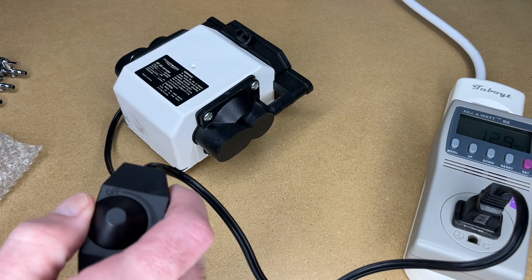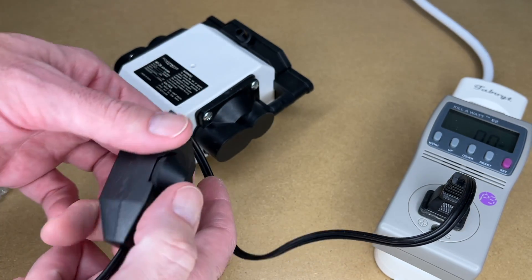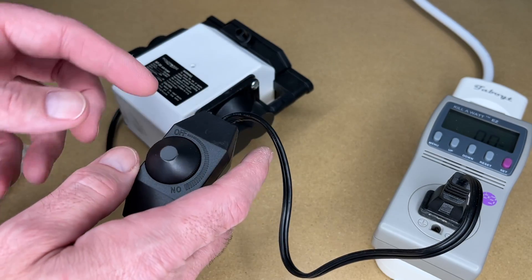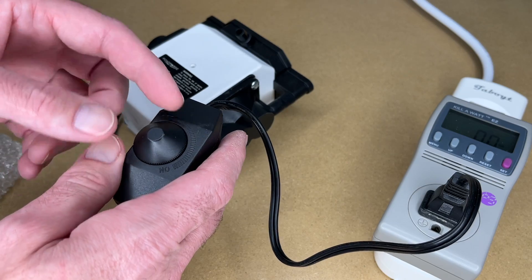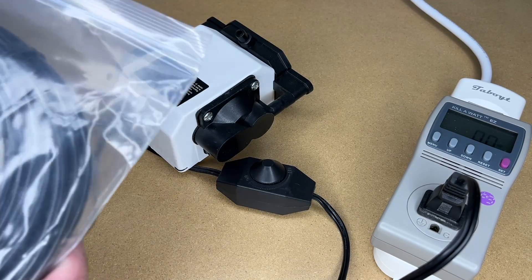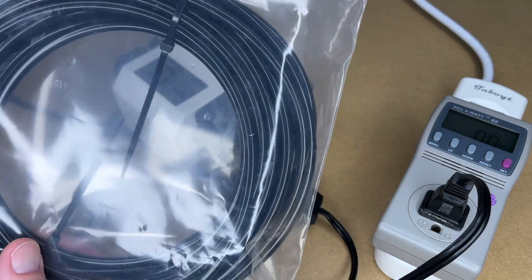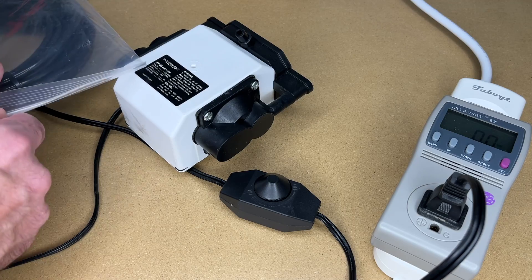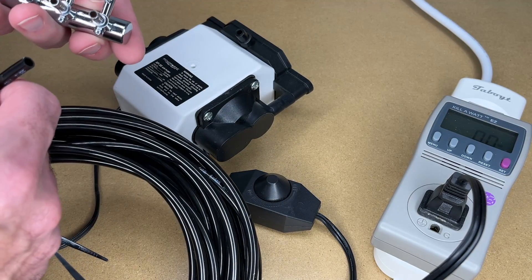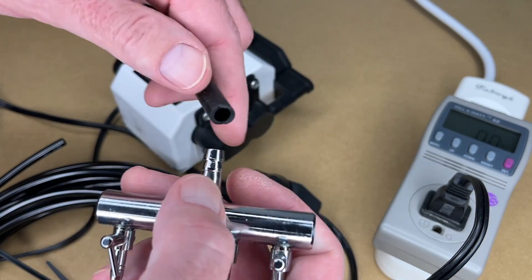If you've ever heard one — the switch feels kind of flimsy. It's something that could potentially be replaced if needed. But if you can dial this in at the air you want, you could potentially hook this up to a power strip or something. To connect this to the laser engraver I have this pneumatic tubing — it's 6 by 4 millimeters, I think it's polyethylene, and I'll put a link below to it also. This will not fit on there, but it should fit on here. It does come with a small tube.